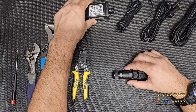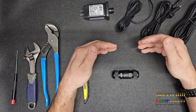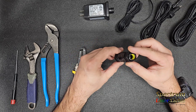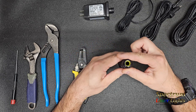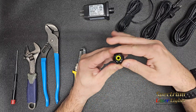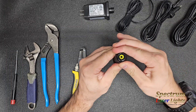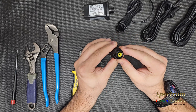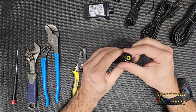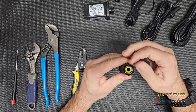The reason you'll use these is if you're making an outdoor connection — these are completely waterproof. They can be submerged up to three meters in depth and stay watertight. When the gland connector closes, the rubber gland inside fastens down onto the wire keeping it completely waterproof.